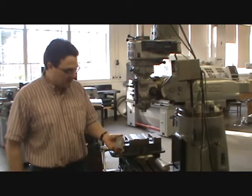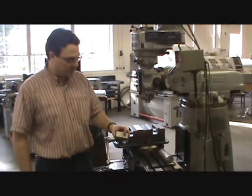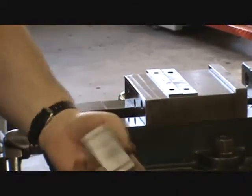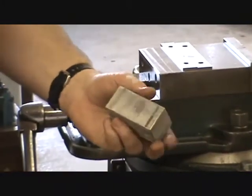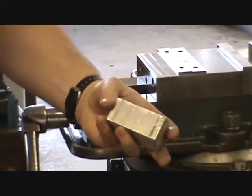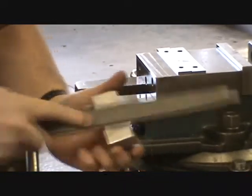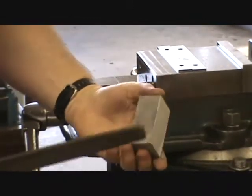Here's a part right off the saw. Before machining, prepare the part by getting rid of all the dings and sharp burr edges — this is called deburring. Run a flat file over the surfaces that will locate against the vise or parallels to make sure there are no dings. When a part gets bumped in transport, it not only goes in but displaces material outward — you'll see little shiny high spots. Get all those dings off all the way around to make sure it's flat.